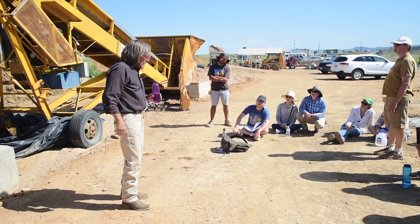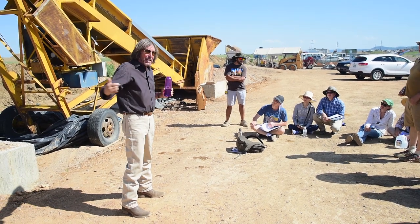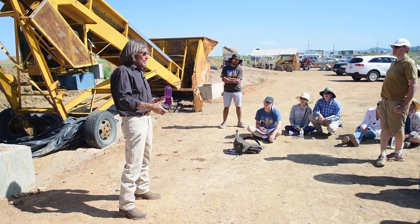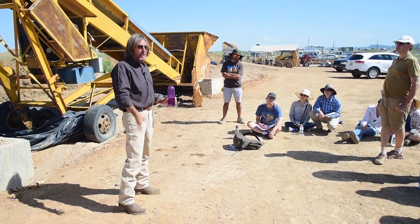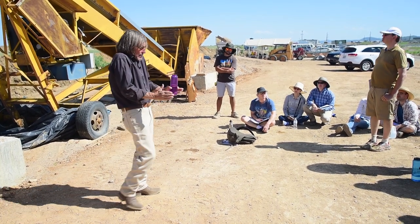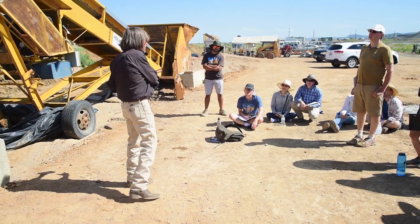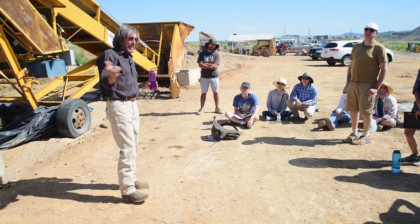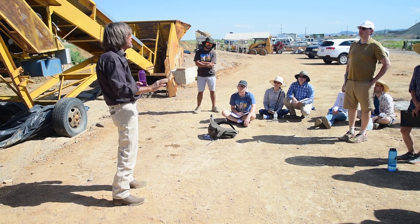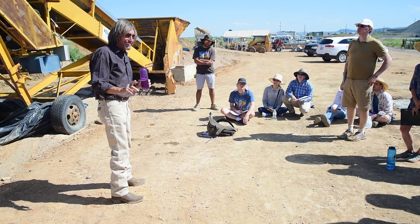You can do it, but what's wrong with it is that, first of all, when the blocks come out of the machine, they're still green. They're not rocks. You can break them. You can break the corners off. You can break the block. It hasn't cured yet. It's a newborn baby. You handle it like this. So if they're coming out of the machine and you've got your masons trying to build a wall with them, they're going to break a whole bunch of them. They're going to knock the corners off. They're going to break them in half. You can do it, but just figure on making maybe 20% more blocks. Ooh. There's a cost, right?